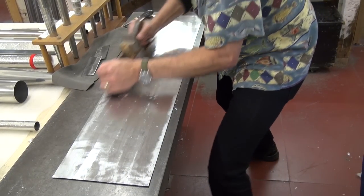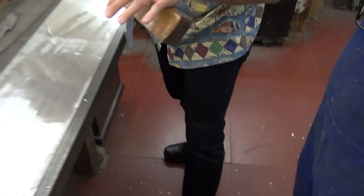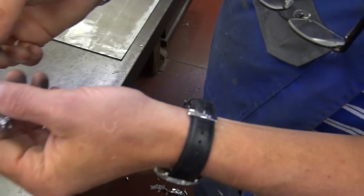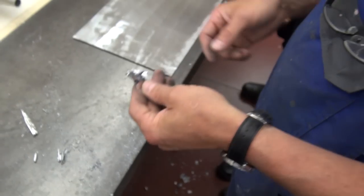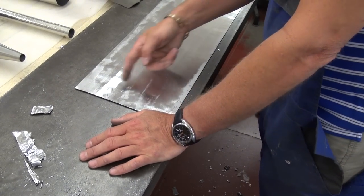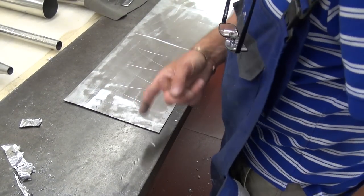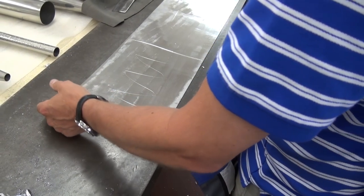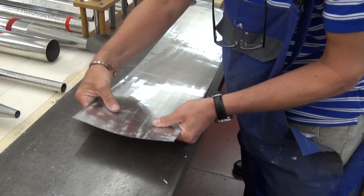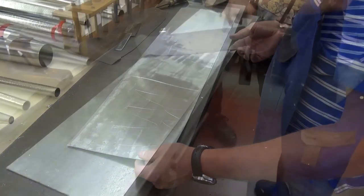If you put more force into it, you'd get a better shaving off — press harder. You're coming off now, that's a nice shaving. You can feel the thickness of it — that's quite a lump off the thickness. With this pipe body, if that was a marked area of the two and two thirds foot, this hand plane pipe would have to be thinner, so it's less plate. We would mark it and go over with the plane until it was thinner. We'd never use micrometers and verniers — we've got them now, but we just feel it. You can feel that it's thinner on that side than it is on that side. We were just brought up to feel the metal.